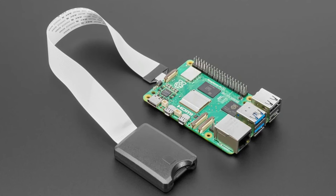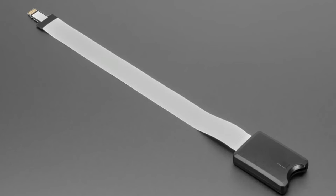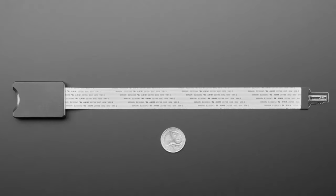This is great if you have a 3D printer or a computer and you want to have the SD card available elsewhere. The one thing to watch out for is that because the card is mechanically inserted, it doesn't auto-detect when it's removed. So it's not good for situations where you need to detect card swaps — it's better for single board computers where you reboot rather than hot-swap. Otherwise you might need to trigger a re-scan, but it's still great to have that access.